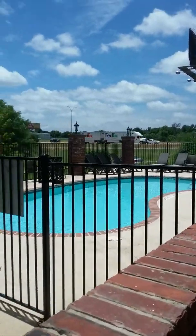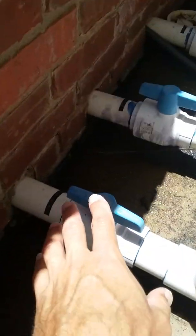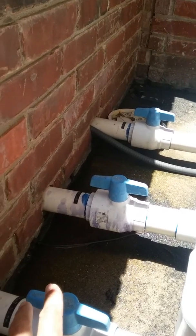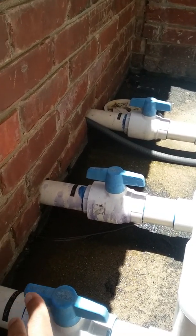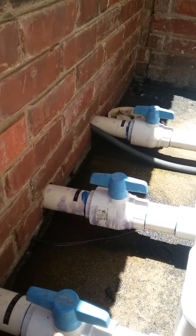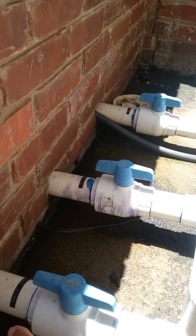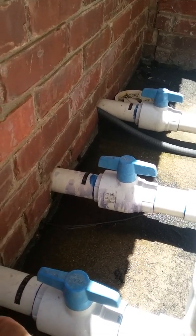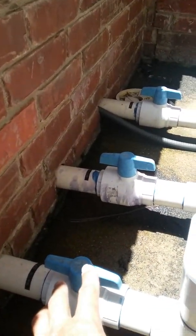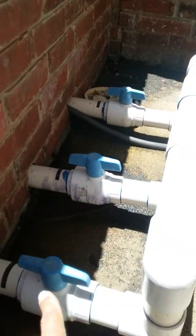And if we want to vacuum the pool, we want to turn usually this knob here or that knob. We want to close it, and you can tell underneath the skimmer basket. You just pull the basket out and feel under there which one is pulling a suction, and that's where you'll put your hose for the vacuum. And you should be ready to go. Just vacuum it, and then after that's done, you put your knobs right back to where they were, which is, this is open right here. All of these are open.